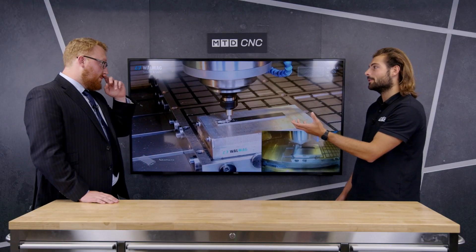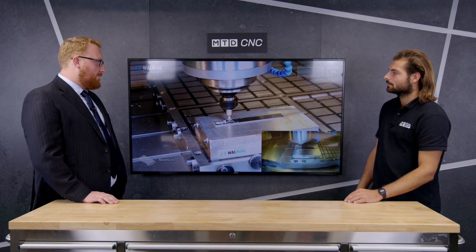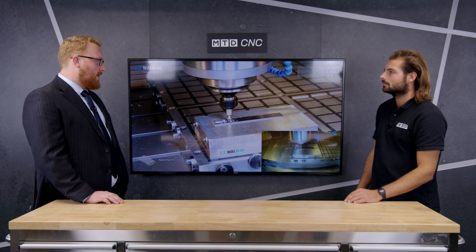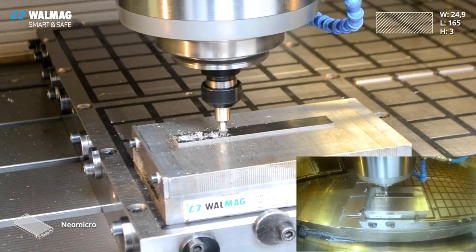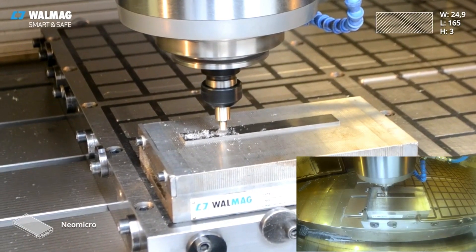So if you've got fragile components, or loads of steel components that happen to be small, thin and fragile, this is the perfect solution? Definitely. The smallest thickness that we can get down to is 1.5 millimeters, which really does leave a lot of options open. The way you go about selecting a magnet for that sort of application is the pitch of the poles — the more fine the poles are. So with a small, thin component, you need quite a fine pitch on your poles to put that optimum amount of grip force in.